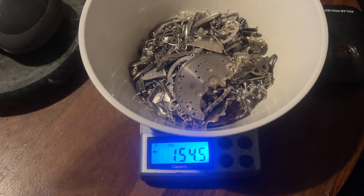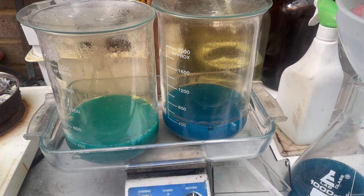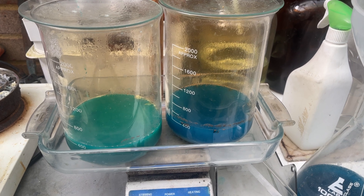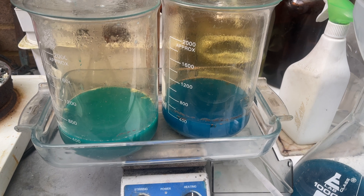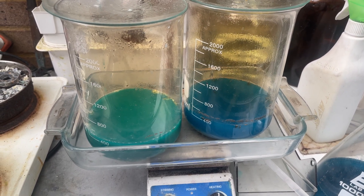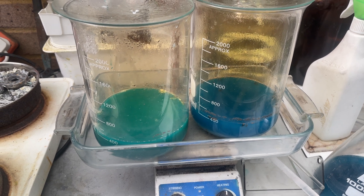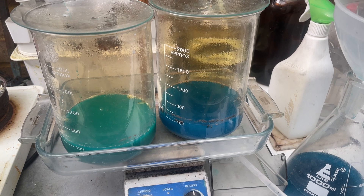154.5 grams — these are the bits I've got from auction. On the right they're rolled gold pieces and maybe some carat gold, and maybe some rubbish as well — maybe some gold plated, I'm not sure. Some of it is really old and vintage. On the left we've got silver, so I'm dissolving them both in nitric acid. I'll drop the silver out after and then we'll refine the foils from the old gold.